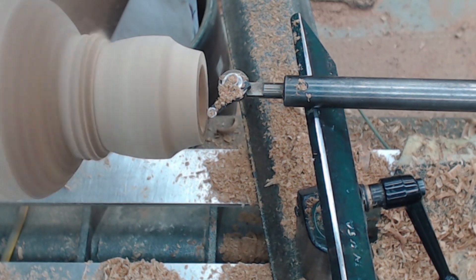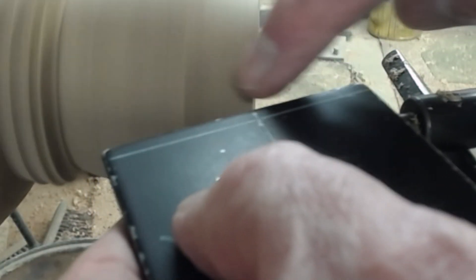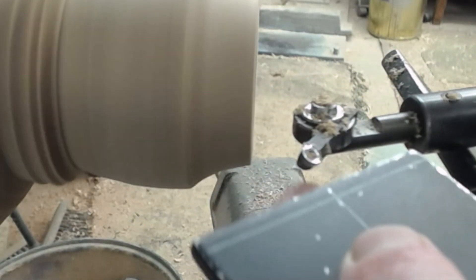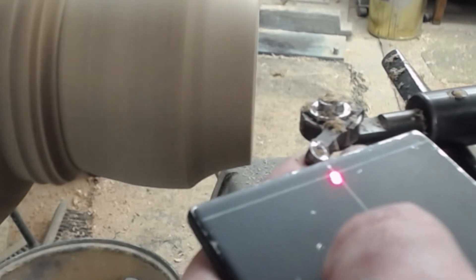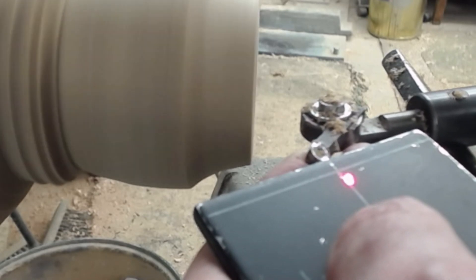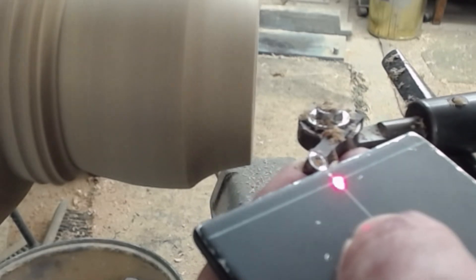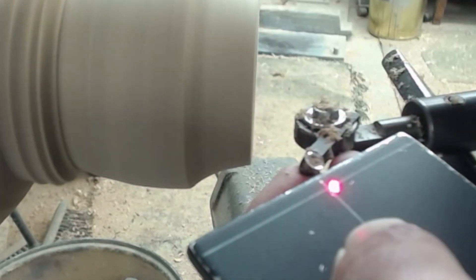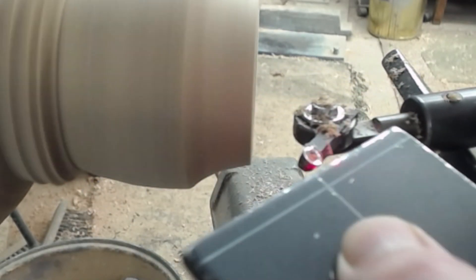So now we're ready to start measuring. We're going to use this card — the long line is a tangent — for the area I'm going to work on. I have to have the card at the right angle of where the area I'm going to work on. Now I'm going to bring that angle over to the cutter and set the laser. We're going to set the laser so that there's a gap. That gap is set at about an eighth of an inch thick. That gap is going to be my wall thickness, my measuring device — my caliper that's going to reach inside there and measure it. That gap is now 90 degrees through the wall, using the card to transfer it over to the cutter.